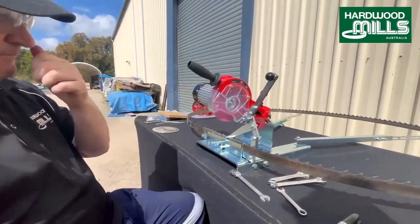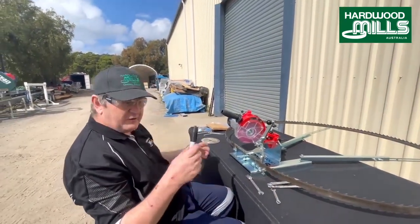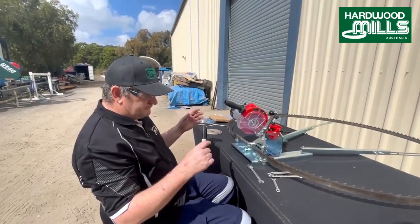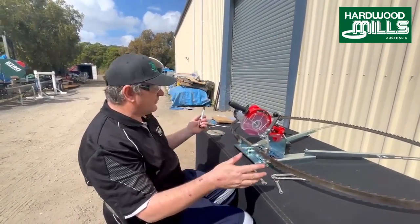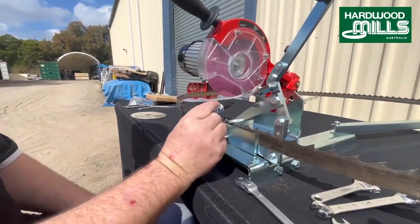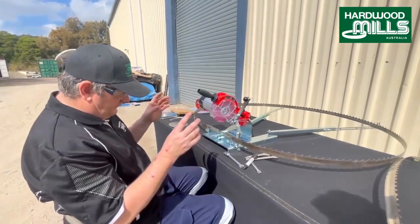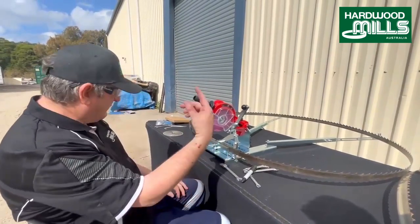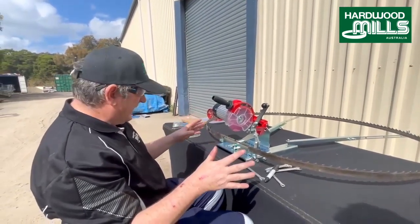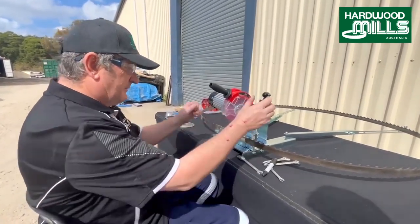Just hitting like that. Okay, so what we're going to do, so especially when you're out in direct sunlight like this, it's very hard. You won't be able to really see where you've milled. So what I tend to do is I'll mark a blade up like that. Now generally you really should start when you're sharpening. You should start on the join, but once blades have been around the machine a little bit, where the blade was welded, it's very hard to find, so you just got to watch it. So sometimes the tooth spacing can be a little bit different. So you're going to come down.